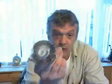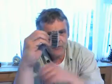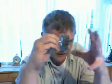What I do is I use this. It's a flap wheel. I chuck it into my drill, fix my drill to the bench, set it going, and then hold the discs in there and lightly take off those nodules. It does a really good job. It does it quite quickly. It only takes a few seconds to do that, and you test fit it as you go, because you don't want to take too much off any particular side.